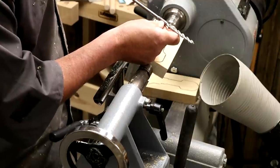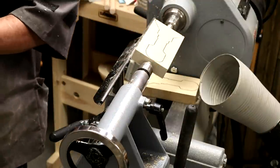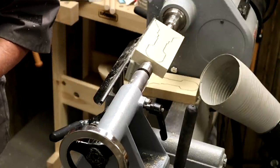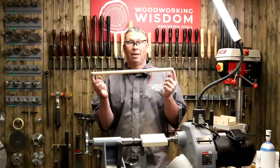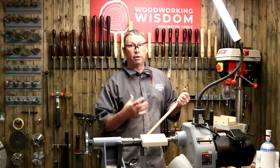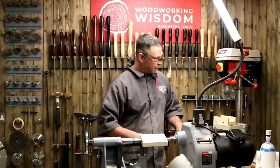8 millimeters. Sorry, 8 mil. So I think it was the... what's on the pillar drill before? Oh, on the pillar drill. The pillar drill was 18 millimeters. To be quite honest, you use the drill size to the dowel that you can get. I got 18 mil dowel, so an 18 mil drill bit. Okay, but if you can only get 20, do the same. If you can only get 15 or 16, do the same.